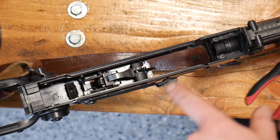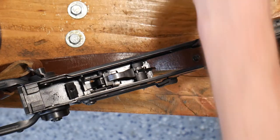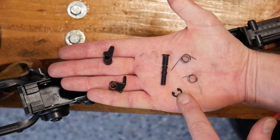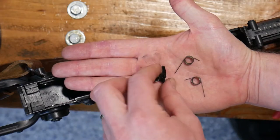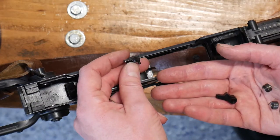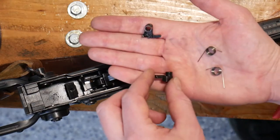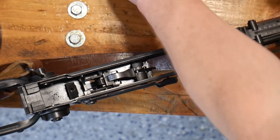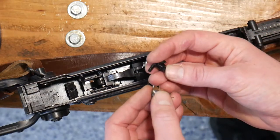I move that back so we can see that the firing pin is now caught on the bottom side of the magwell. What we will need for this last section are our final remaining pin, our final remaining circlip, our two springs, and our remaining sears. This one is on the left side of the receiver and is the cutoff lever — so if your magazine runs dry, it pops that up and makes it so your gun stops firing. This one is our auto sear. Let's start with one and then move forward from there. I like to take these one at a time.